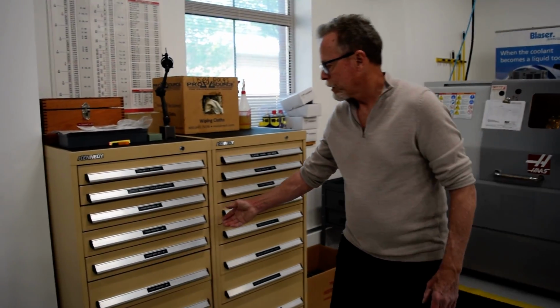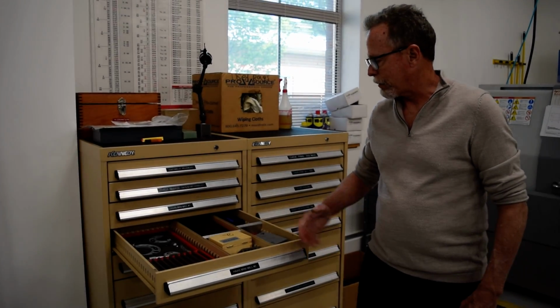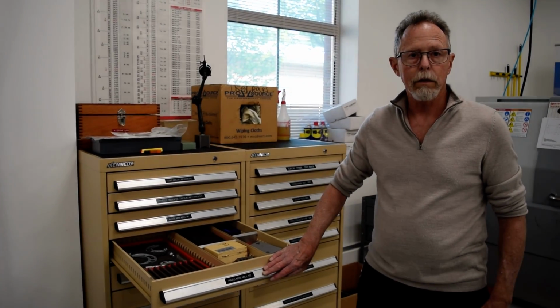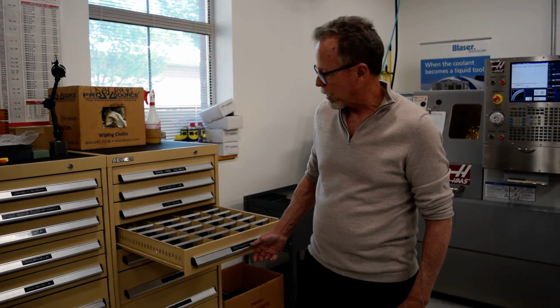And you can see that in the tooling cabinets, we have a drawer for each machine. They have an identical set of tools in here, so that no student has to go hunting around. It's far more efficient. And again, they learn where the tools are and where they go at the end of the day. And our related tooling for the machines, collets, and that sort of thing are well organized as well, so they know where to find them. So they're introduced to the lean concept in the conventional lab, and it's maintained throughout the course.